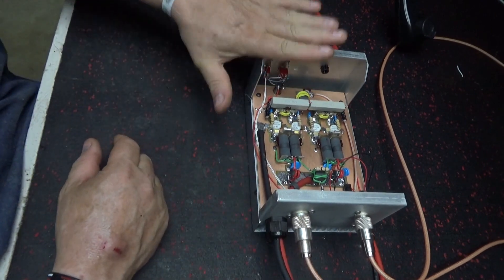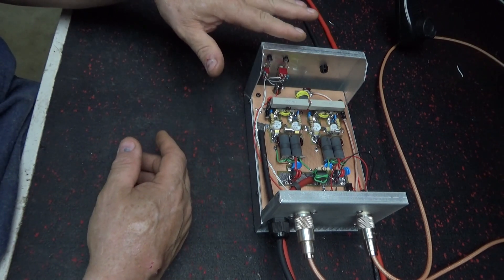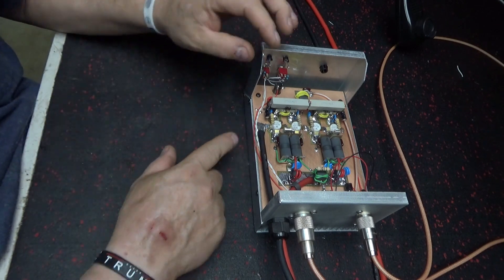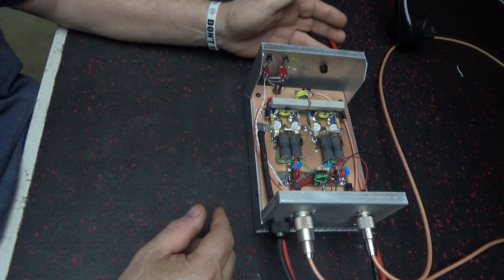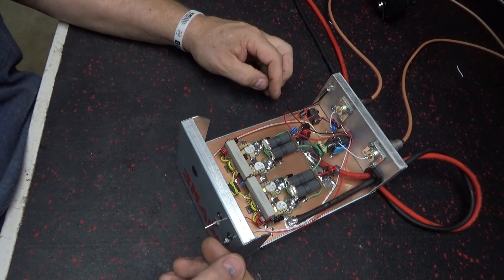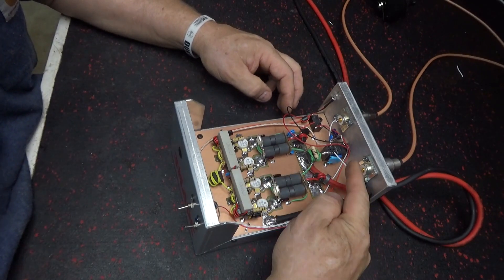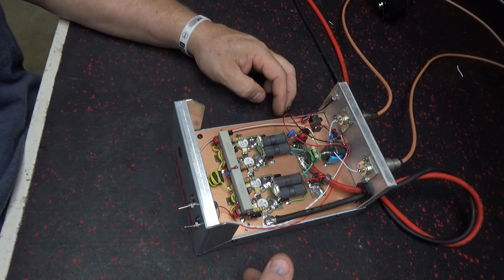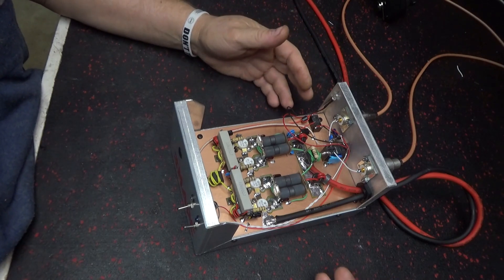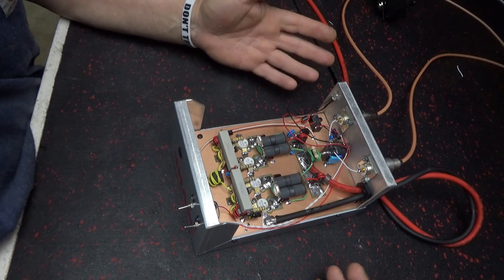You can switch it on two different ways, or maybe more than that. You can switch the grounds or you can switch the hots. Anyway, to solve this problem — what it was doing was the coil, when you turn this switch on here, it would throw a little bit of juice over there to that cap, and that cap would feed back. You could sit and watch that LED and it would go dim, very dim. It doesn't take a lot to run an LED — you can run an LED a long time off of hardly any power.